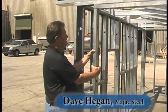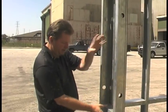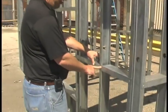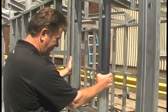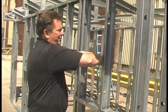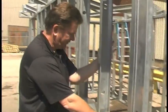A couple of things we want to show you in the characteristic of this building: these are double studded and they're interlocking. I don't care how much you try to turn this — you can't twist this piece. It's very solid. If you notice the concept of the noggin lines, they're designed into the software. When they're rolling out on the roll former, it actually cuts out the holes in the track which come down and we insert the studs into the noggin lines for more stability. These babies, there's no bending this stuff — you'd hurt your hand trying to bend this steel.